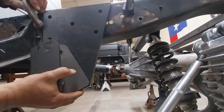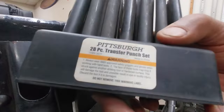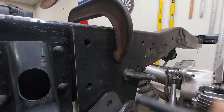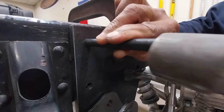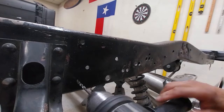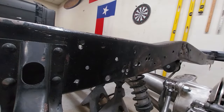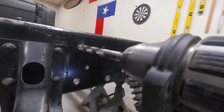On to the placement onto the frame. We're going to be using these transfer punches to go through the plate onto the frame — again keeping in mind the accuracy of the holes; we want everything to line up really nicely. I don't like drilling holes and then having to waller them out, so we're using a smaller bit to start with.